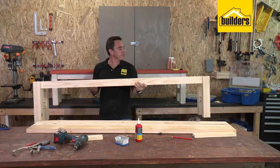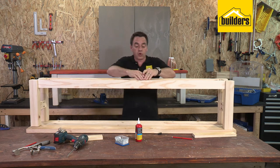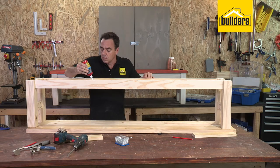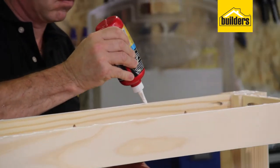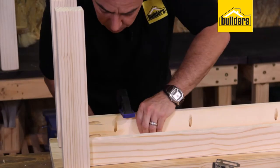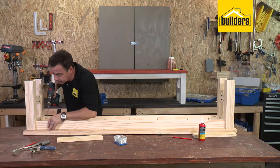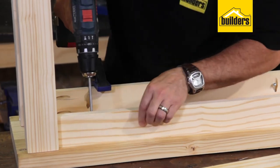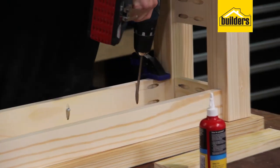There's the bench frame and legs complete - very simple and easy to do. All we do now is put some wood glue along the full perimeter of that apron and on the bottom of the legs, then position it in the middle of the board and fasten it down with some more Kreg screws. I'm going to use a clamp to clamp it down nice and tight. First screws in - I find it easier to do the opposite sides as well just to stop any movement as I work my way down.